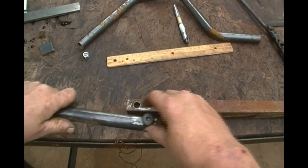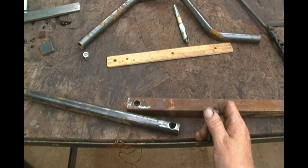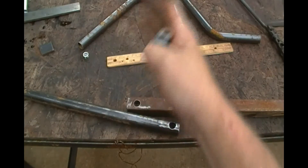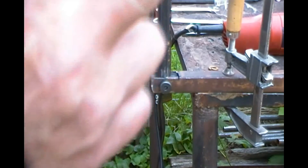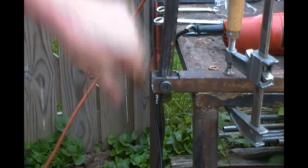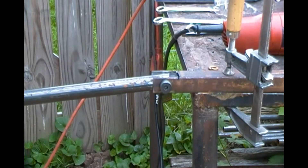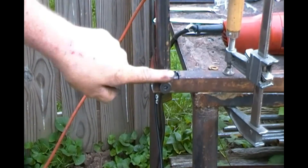The angle is just so that it doesn't come straight off the bike — it leans forward a little bit to help prevent it from falling over in the event you're on a hill or the bike decides to roll forward an inch. The kickstand doesn't automatically collapse; it's already leaning forward a little bit. I'll have a nylock nut on this so it can't unscrew itself. That'll be fully up, and that'll be fully down.